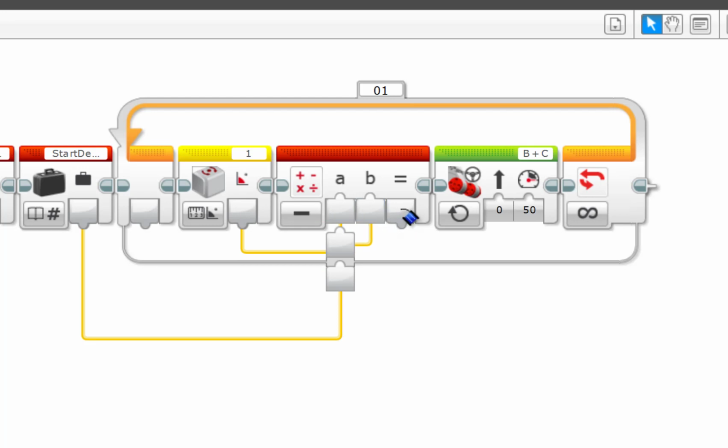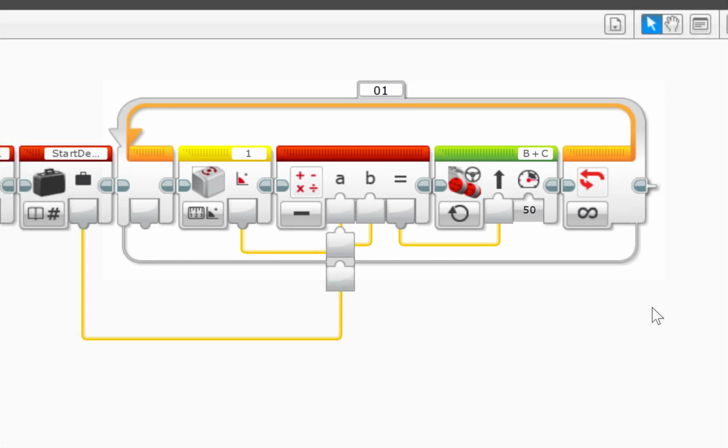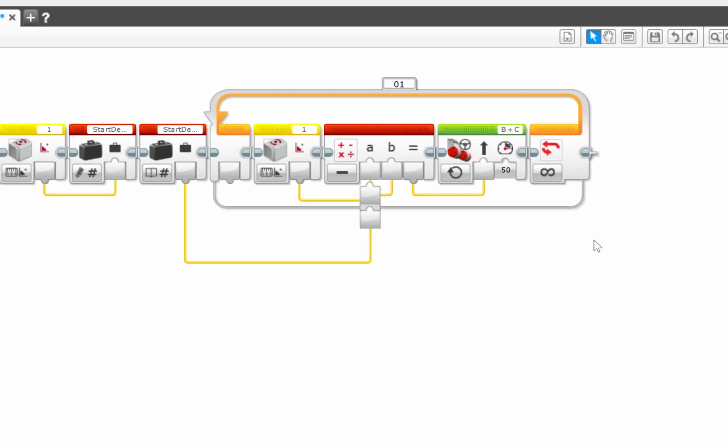The answer to that then is going to be the direction of the curve. So if these two match, it's going to make it zero, in which case it'll keep going on a straight heading. If this is off slightly, it will automatically adjust that heading. What's going to happen with this loop is it will happen over and over and over, probably 100 or more times every second, and it's going to quickly adjust the direction as it goes through there.